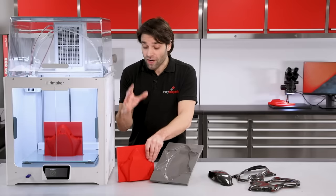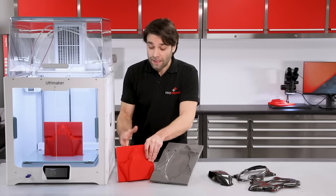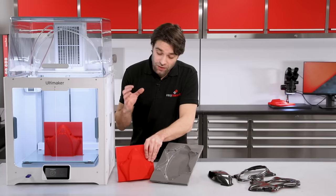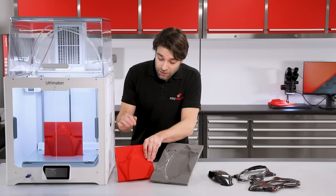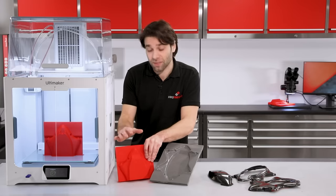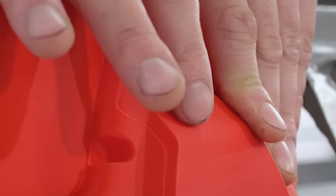I'm not going to go into any great detail on how I actually did these prints. There's loads of information out there if you want it. But in essence, I used the draft settings straight from Cura with a 20% fill to do these patterns. Now, the surface fidelity might not be the highest with these settings, but as we're going to go on to coat them with epoxy resin, that really doesn't matter. So I chose speed over refinement.